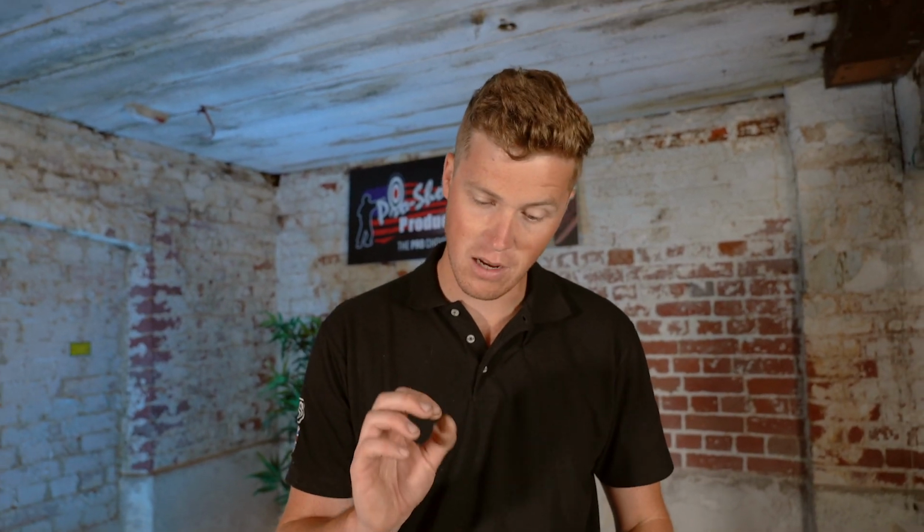If you buy yourself a graver set and run over your laser checkering, you will end up with denser points and slightly better finish. That is something that is very worthwhile and something that we actually do quite a lot to people's guns, because you end up with a nicer feeling checkering. It feels less coarse, but does the same job as the coarseness that it had. There you go. A superior grip. So it is worth having hand checkering.